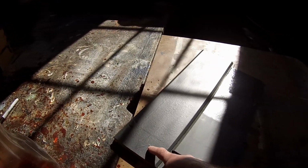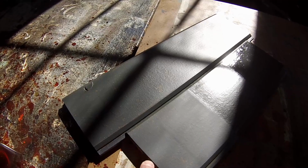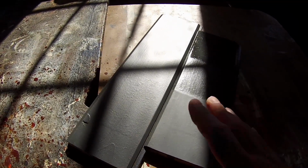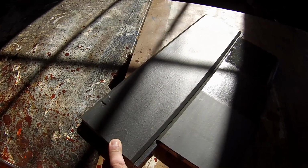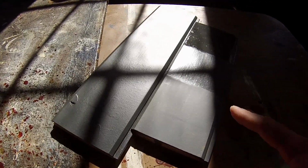So this sample here was the original sheen before I put all of these other varnishes on this other sample here. These were two matching finishes. So you can see the difference in color. This green looks a little bit lighter than this green, but that's just a difference in the sheen. I just added a slightly higher concentration of the gloss into the mixture to do this varnish. And I do that on darker colors so that you don't get that pasty effect. Because if you make it too flat, it actually lightens the color a little bit.